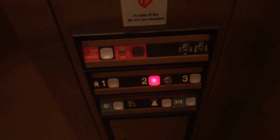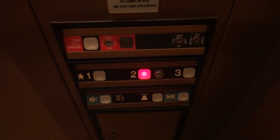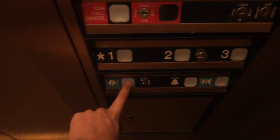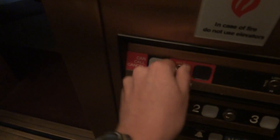On elevators, if the floor is locked, it will go to a locked floor. Open the door and make sure the door is all the way open. This is the floor — the call buttons are disabled. Stick in the fire service key to hold; the elevator will stay on the floor.